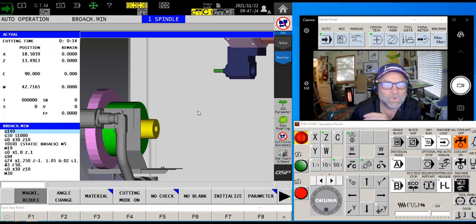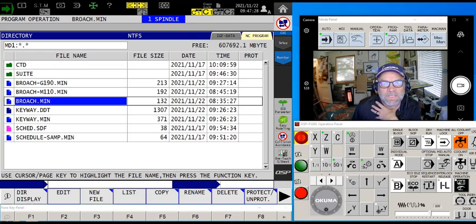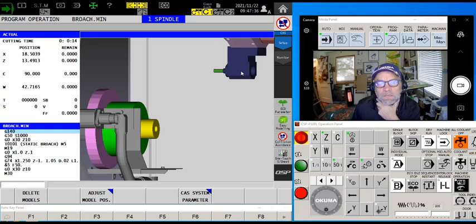I've made several different programming examples we're going to look at. I put this in a solid boring bar holder. It's not recommended to do a static broach like this with a live tool — the bearings of a live tool are really not designed to take this kind of axial load when they aren't rotating. You're probably going to pit your bearings or the races. So I put this in a static holder, clamped on it good and tight, because the pressure in the Z-plus direction is going to be pretty significant.